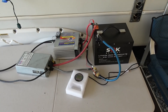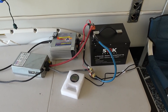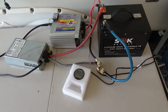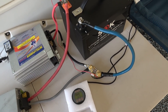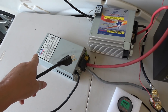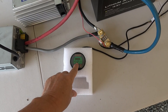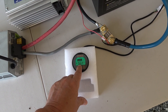Let's do a few tests. First, a charging test — this battery should handle a max of 100 amps. I have a couple of chargers here to put a significant amount of amperage in. I'll also do a capacity test to confirm it handles the rated 100 amp hours, then a high-amperage discharge test. Starting the charge test with the IntelliPower putting in 37 amps, then adding an IOTA DLS-55X — we're now over 54 amps. Hitting the boost on the IntelliPower brings us to a solid 76 amps.